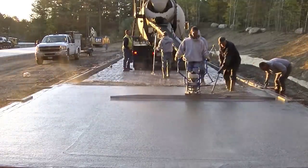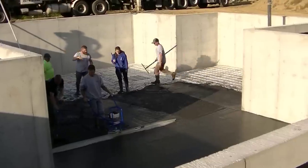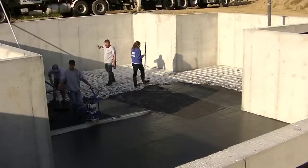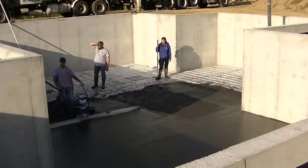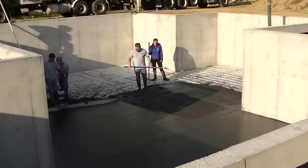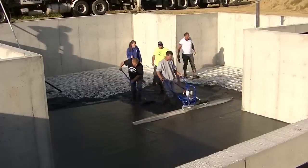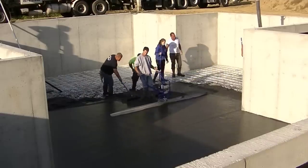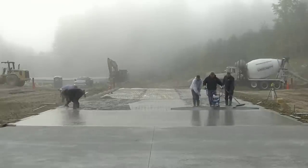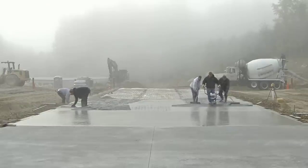You can see the very little effort I'm putting in — I just need to hold this thing steady, give it a little bit of throttle, watch my two ends, and make sure both ends are touching leaving a tiny little line, which means I'm getting the floor nice and flat. Here we are again down inside a basement foundation pouring some colored concrete, just screeding the concrete off. The concrete is about a five to six inch slump, with three-quarter inch aggregate, and it screeds off really nice. It vibrates the surface a little bit to bring up some paste, making it nice and easy to bull float.